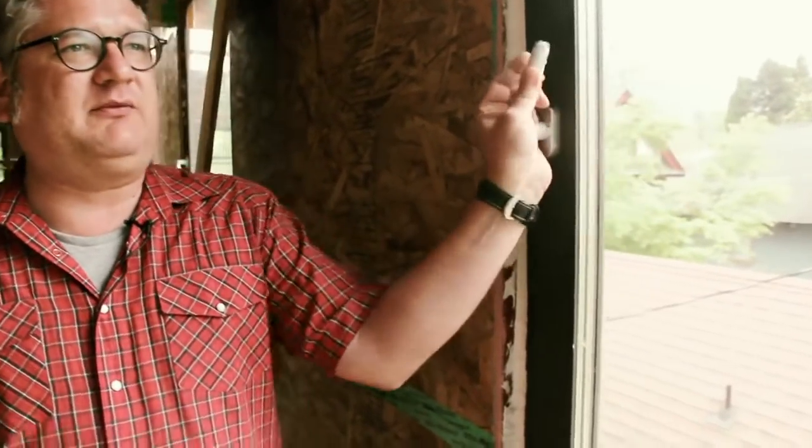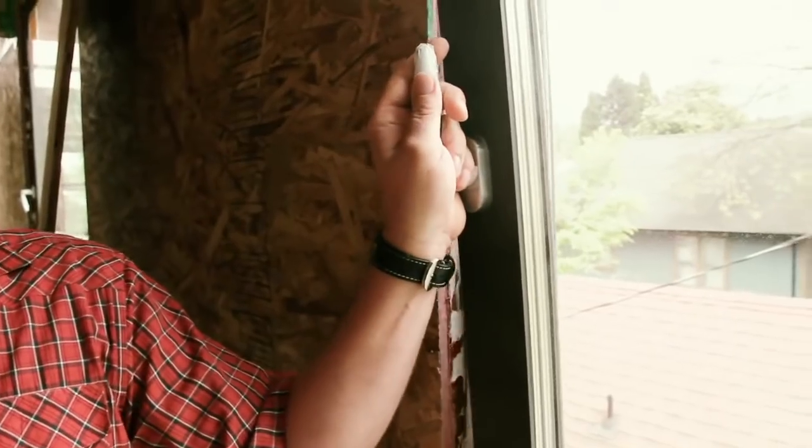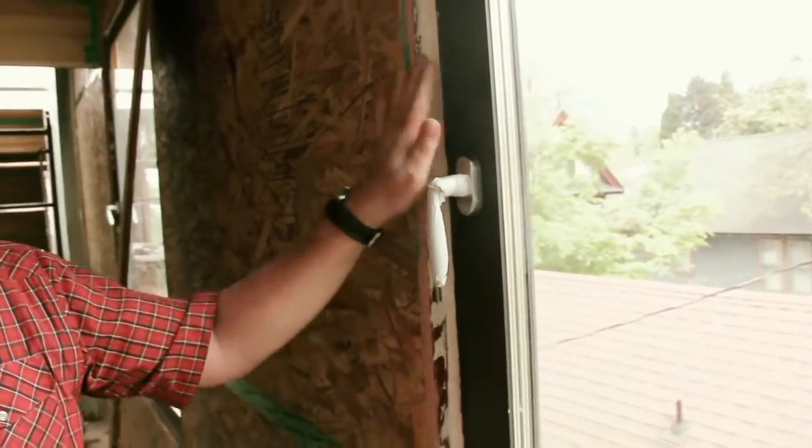Our windows in this building are a Cascadia 300 series triple-paned fiberglass frame with EPS insulation on the inside of the frame. These are a European operating window called the tilt and turn. They tilt in at the top and they also can change position, and if this one weren't intentionally limited for code reasons, this window would swing in like this.